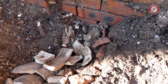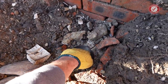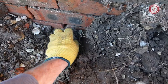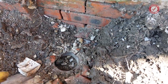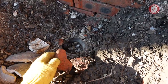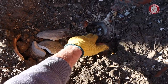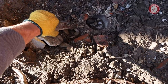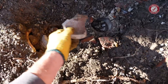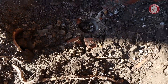None of this is caused by me - this has been like this for years and years. Here's the bottom of the trap - this is going to get a little bit minging. I'm trying not to get extra stuff down it because I want to show you what it was like. Not only would this have caused problems for water getting out of this trap, but little bits of broken clay will have ended up going down the drain and into the main public sewer - and that's what causes blockages folks.